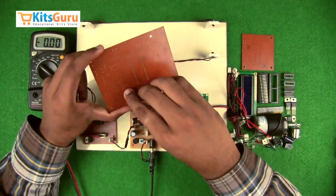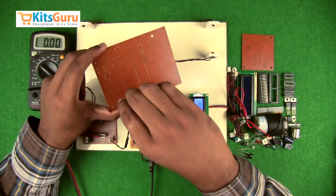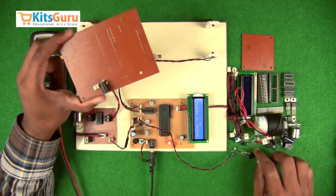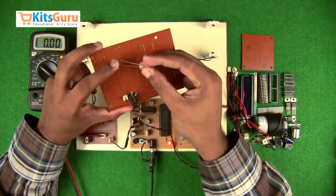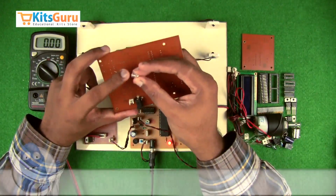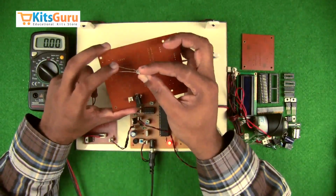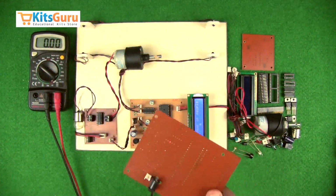Starting off with the power jack. This is a power jack, and then a 2-pin connector. So a 2-pin connector here is used to give a power supply to the transmitters, as you can see. The transmitter is like an LED. So the stem which is longer in length is the positive terminal. In case both the stems are of equal length, the bulb on the transmitter is usually round, but at the negative terminal it gets flat. So that's how we come to know that it is a negative terminal. So the positive terminal has to be connected to the positive terminal.